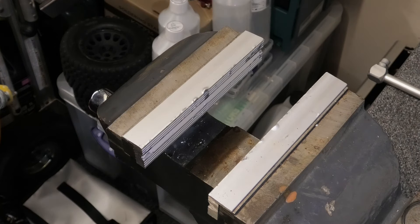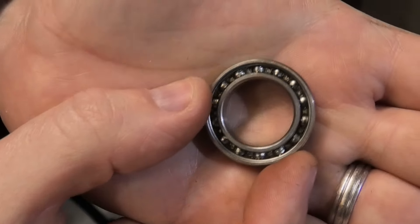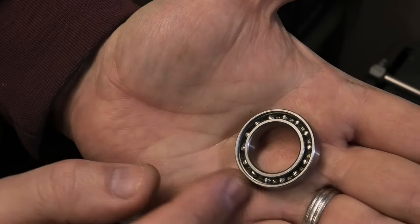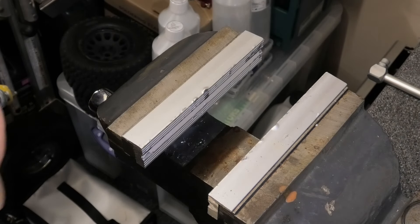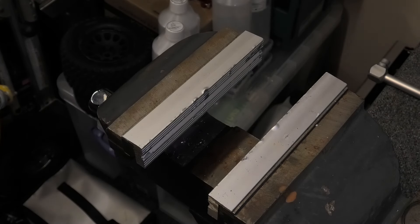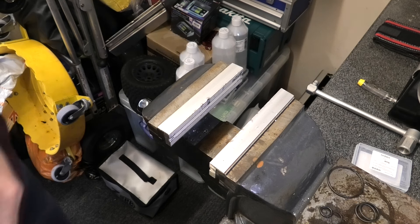I do tend to find the bearings don't come with a particularly large amount of grease, so I like to pop the seals out of both sides and just add a little more grease so I know they're sufficiently lubed up. You don't need to over-pack them — just a small amount around the outside. Pop the seals out with a small blade, and my grease of choice is Castrol Spheerol EPL2, which is a good high-speed bearing grease suitable for high loads and fast spinning. We're going to move on now to the reassembly.